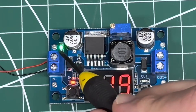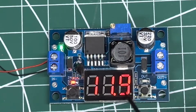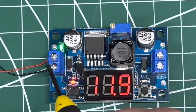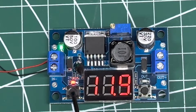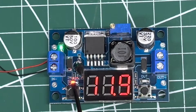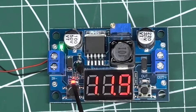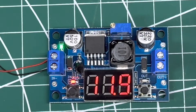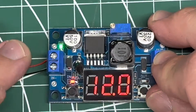It's got three different LEDs. One is for the power. This LED is specifically associated with this voltmeter display — the display currently says 11.9 because I've got 12 volts coming in, representative of the voltage it sees coming in. This button here is actually just display on/display off. Do not confuse that with turning the module on or off — it's just the display. So if you're integrating this into a costume or whatever you're doing with voltage conversion, you can get this out of your way.